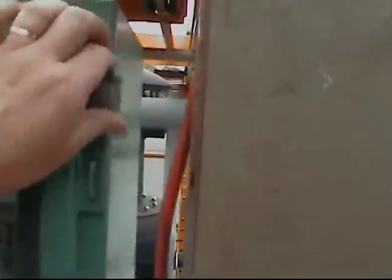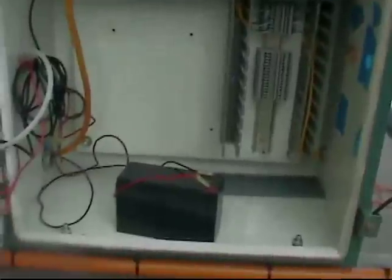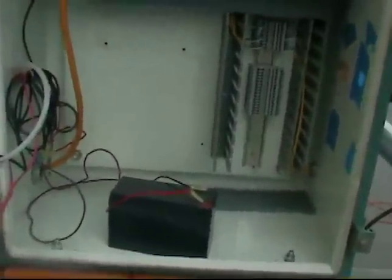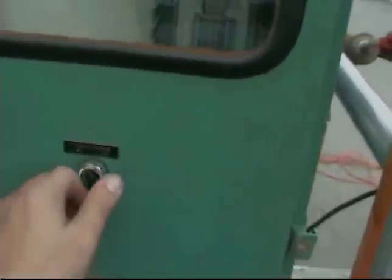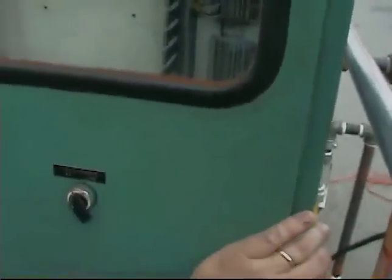Also, a little bit of work done inside here. I did start to wire those RTDs, so technically they are wired all the way up to the card. Of course, I don't have the license for the software yet, so that's yet to come. But I have a lot more wiring to do in here, obviously. And right now, I don't have a 12-volt power supply for the ash grate shaker, so I'm using this battery, and that's just off this switch right here. So when I want to shake the grate, I just flip that switch.